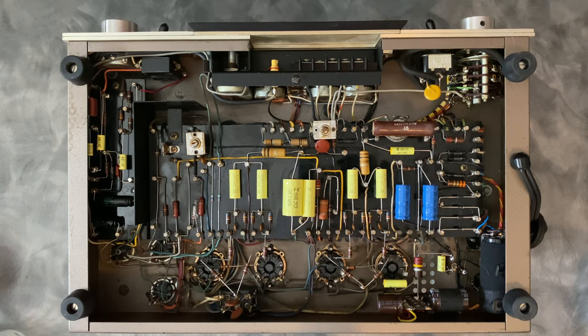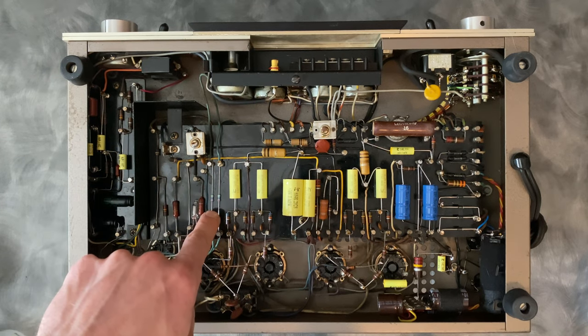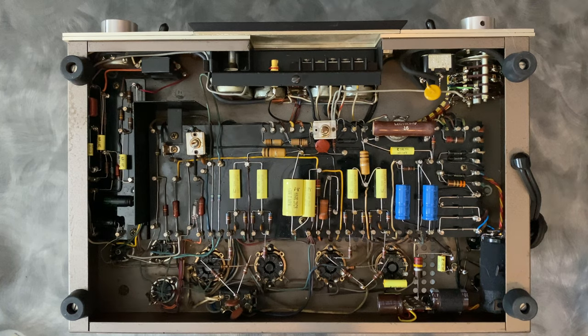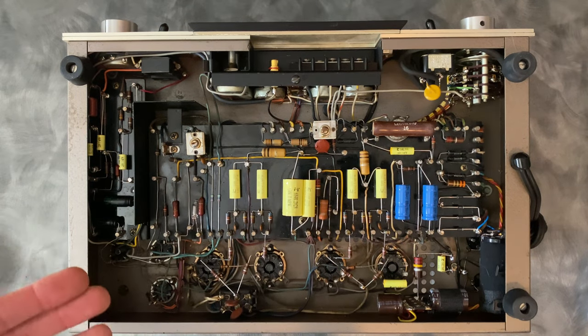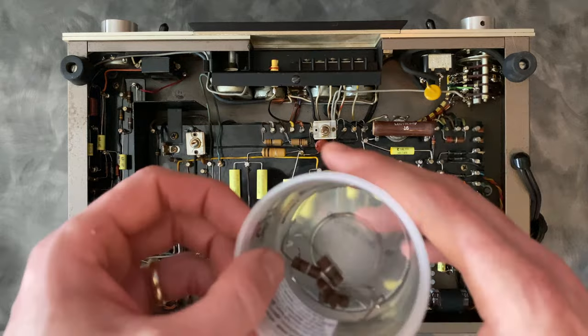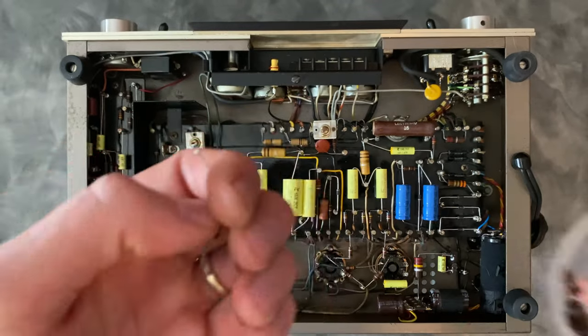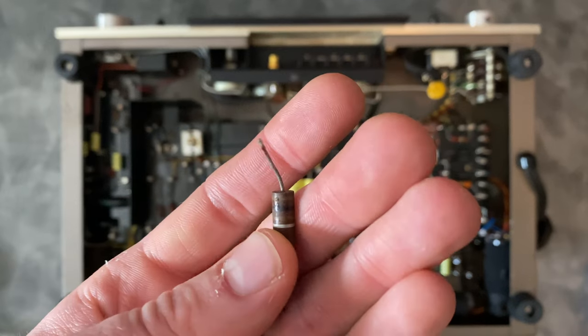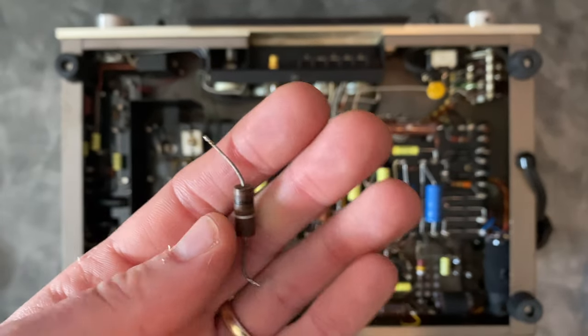Another resistor change that I dealt with was in this section here. These are what are called deposited carbon in the manual, which corresponds to carbon film resistors. So those got replaced in both amplifiers because I needed them to match. This one also got a strange modification. The screen grid resistors were upgraded from half watt to 1 watt.